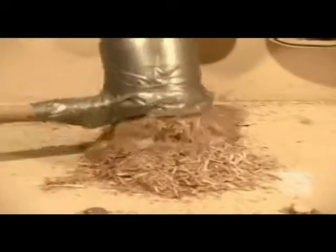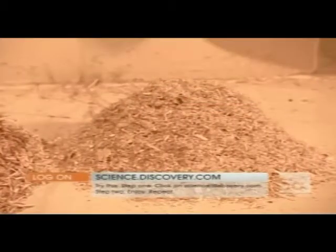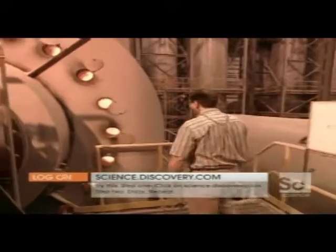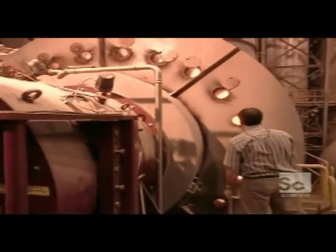When the milling is done, the particles are between .008 and .5 inches in size, and less than .03 inches thick. To make the humidity level uniform, they put the particles into giant dryers, whose combustion chambers are fueled by leftover dust from the chopping mill.